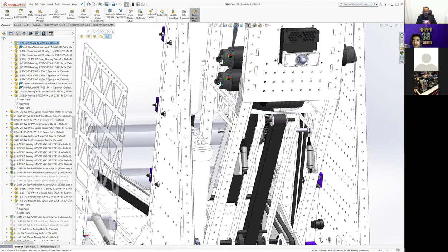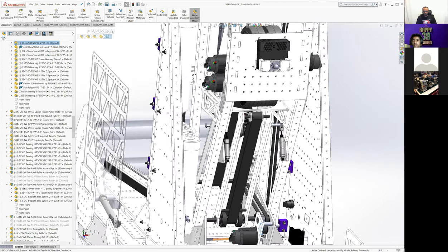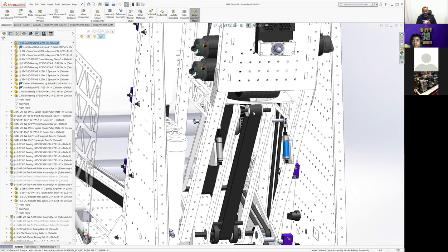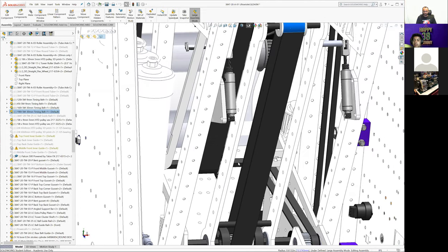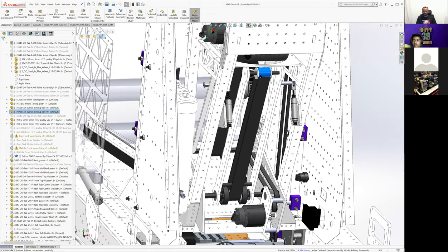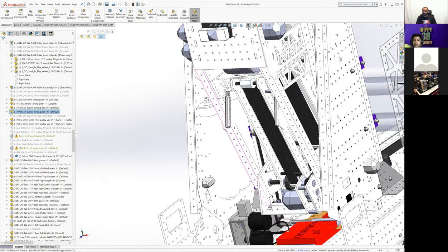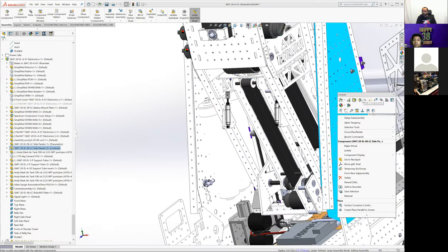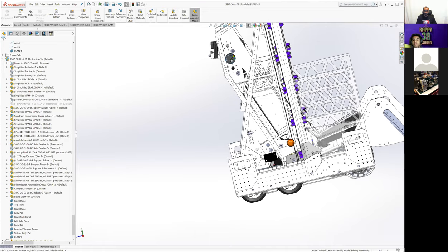So largely what we do is while we're feeding and intaking, these pneumatic cylinders here are pulling this top pulley backwards along an arc. So it's not mounted anywhere along these sides. It's pivoting down here along this bottom shaft. So it's mounted on bearings here. So it's able to pivot. And since we're pulling it away, basically the whole tower loses compression as we go up. That mostly works.